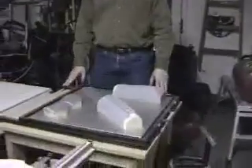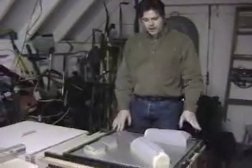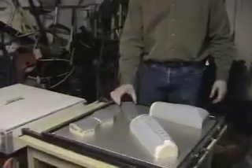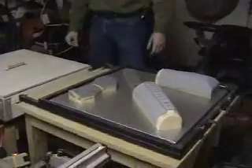We're out here in the workshop. This is a Thurston James model Vacuform machine. It's got a holding frame that's two-foot square. The forming platen is 21.5 inches square. I've got it set up to pull forearms and hands and a little knee strap thing — Bill wanted a couple of parts for some custom Trooper he was making. It's two parts to a machine: the vacuum side and the heater side.